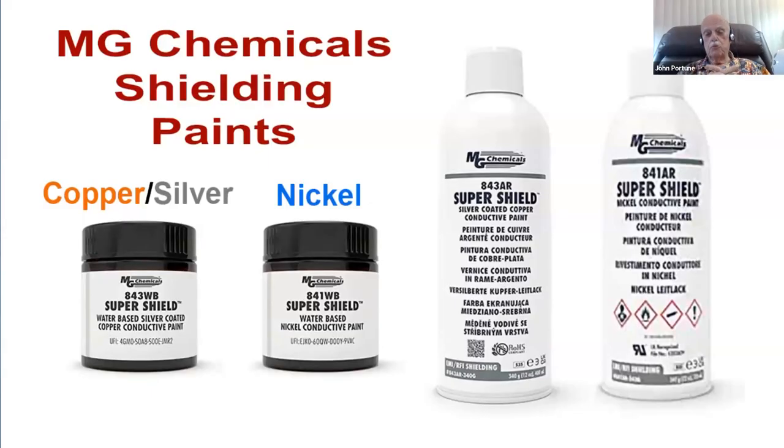You can also paint the inside of those elbows if you want to with the shielding paint, which you can get from M&G Chemicals. They make shielding paint, which you can paint on the inside or spray on the inside. Although this stuff is relatively expensive, the shielding paint is very conductive. You can buy it in copper, silver, or nickel. Nickel has nice metal particles inside of it.